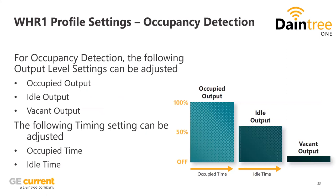What do we get with all of these controls? We get the capability to control illumination — not just on/off getting LED savings, but controlling based on whether somebody's in the space. We break that down into three tiers: Occupied — somebody's underneath the fixture working, maybe wanting 100% illumination — you could have that one fixture at 100% where the person is working while the rest of the distributed mesh zone is at an idle output of say only 50%, because you want the area illuminated but not at full bore.